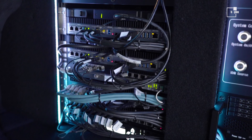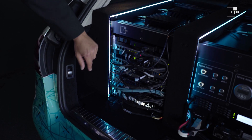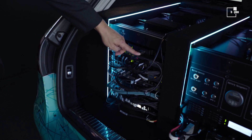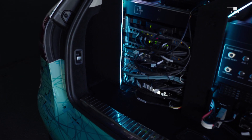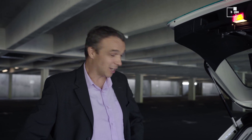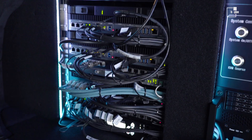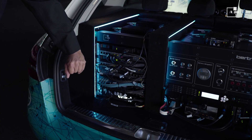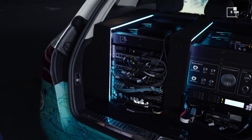The system consists of a first brick and a second brick, both connected by 100-Gigabit Ethernet lines, with at the bottom our so-called MD-Lake — the mobile data lake system. This is a 60-terabyte storage system, and of course you can get more storage as well. In addition we have CAN, additional Ethernet, USB, and other connections, and the most important additional part is our Gigabit switch.